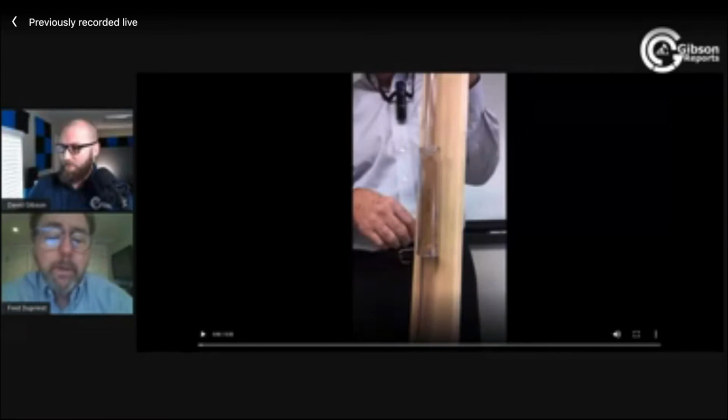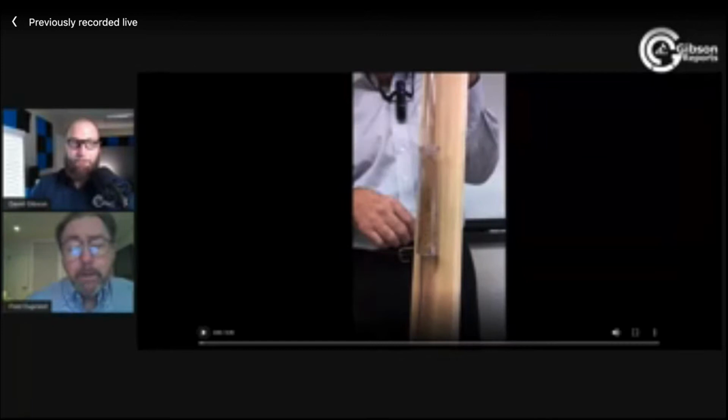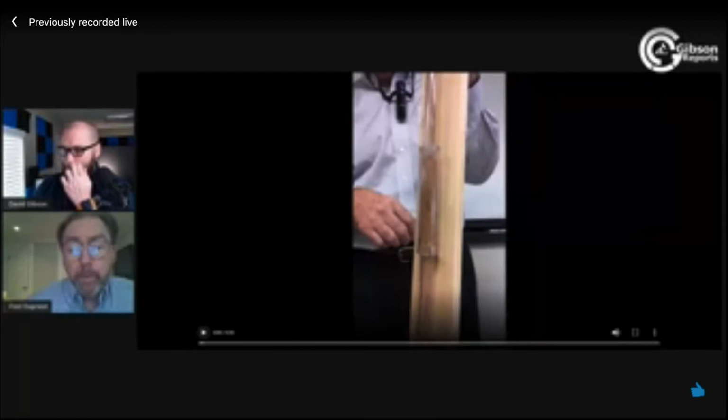So what I've done is I've taken this enlarged section and turned it vertically, you know, bent the tube up vertically. So the cuttings are coming into the gauge hole and they're rising. And what you're going to see here is that as they enter the enlarged hole, which is about equivalent to an 8.5 hole going to a 12 and a quarter hole size, not a big enlargement.